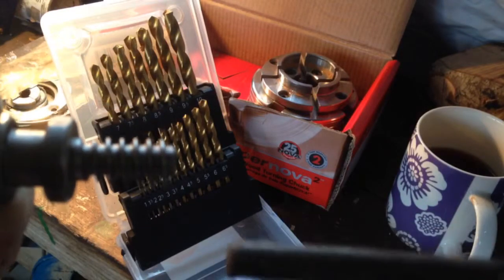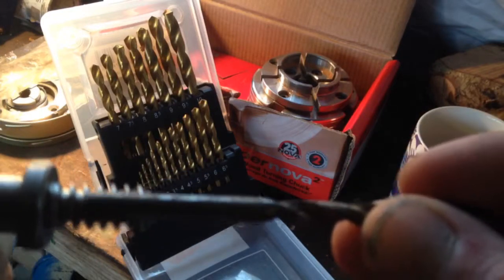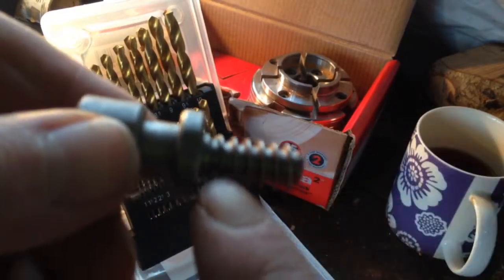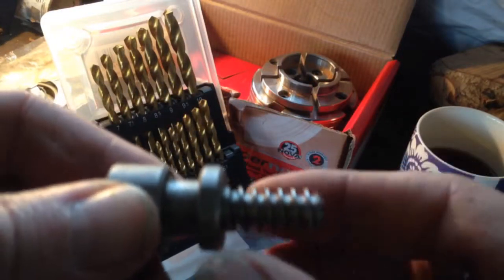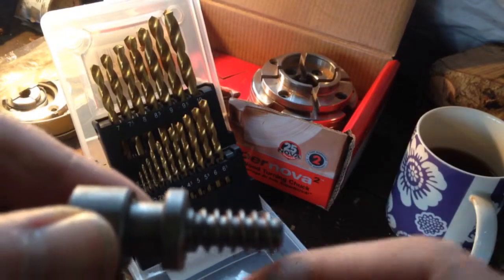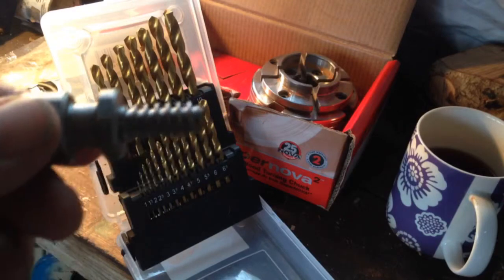Now to choose a drill, I find it quite helpful to get another drill. This drill has to be exactly the same width. This one's too narrow. It has to be exactly the same width as the solid portion through the middle, because that isn't a screw, that is actually a metal rod. These are the bits that have got to bite, so we really want to leave this whole area where the teeth are to actually bite into the wood. So it's going to be really good to get a drill bit that perfectly matches down the middle.